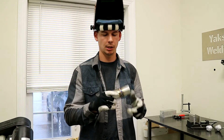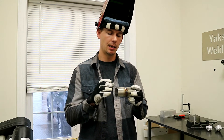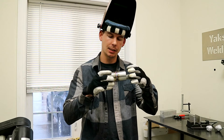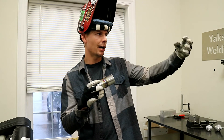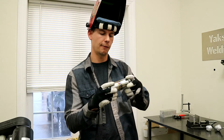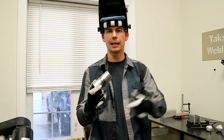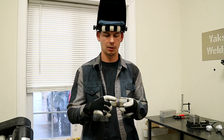A TIG welder will pay for itself — you don't have to pay anybody to do it. You can do it in your own garage and get an awesome product if you do it the right way. Make sure you clean the material really well, deburr the edges, and make sure that you don't have any large gaps. Stainless has a tendency to pull real bad — if you have gaps and start welding, it'll start pulling towards each other, and if it's a longer piece of tube it may kick over a quarter of an inch and affect everything else. So make sure you have tight fit-up, everything's clean, and back purge — that's the keys to success with stainless. Thank you guys so much for watching; like the video, comment, subscribe. Sorry we missed last week but the shop's busy and it comes first — we'll catch you guys in the next one.